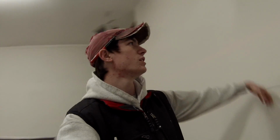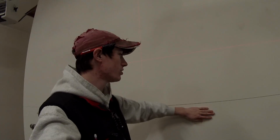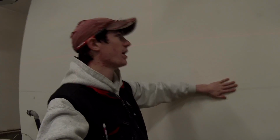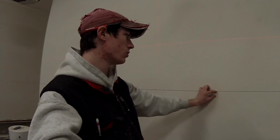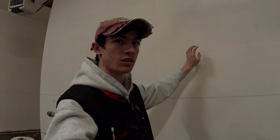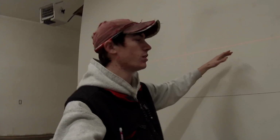We are also gonna epoxy the floors, which will make a real big difference, and it'll be a lot easier to clean up oil stains and stuff. Basically, what I'm gonna do now, when I figure it out, is paint over the lines a little bit with the black. I'll put 2 coats of black on because it is a dark color, where I cover the line, and that way when I come back I can tape over the black with the level as my guide. I can tape over the black and make sure it's perfectly level.